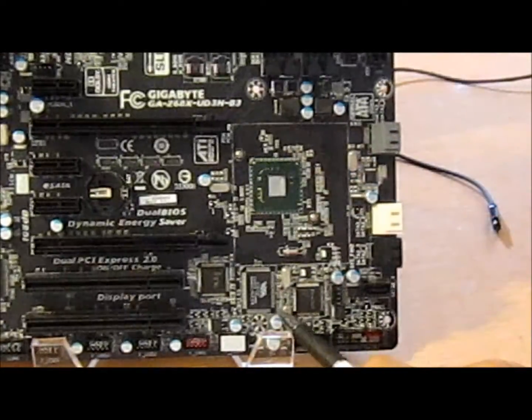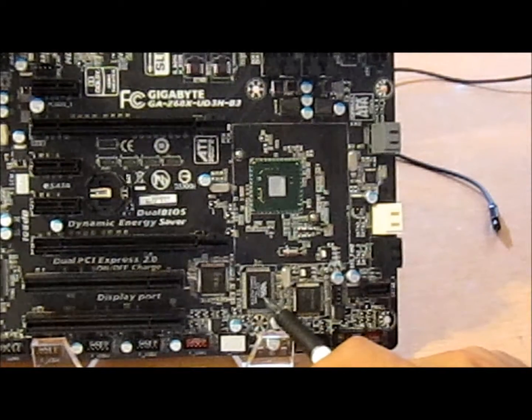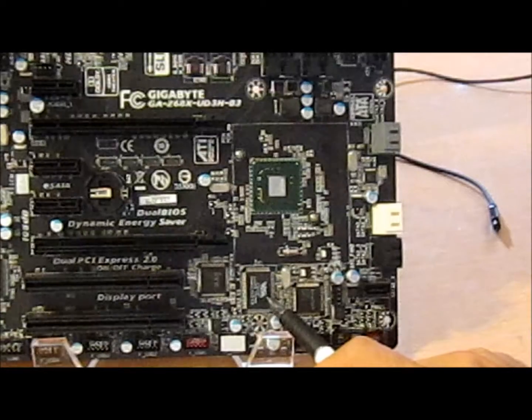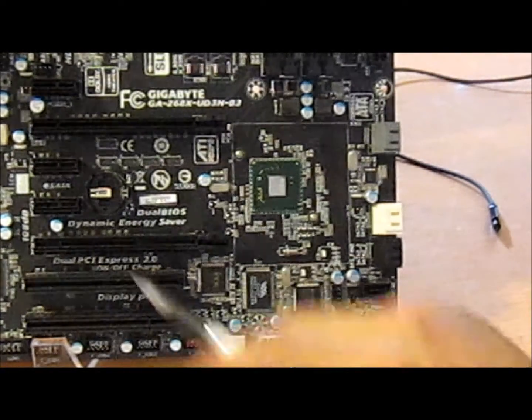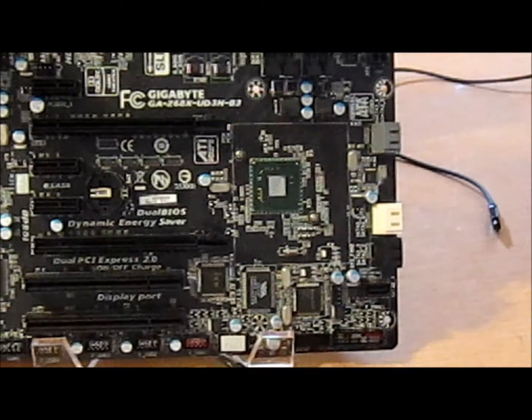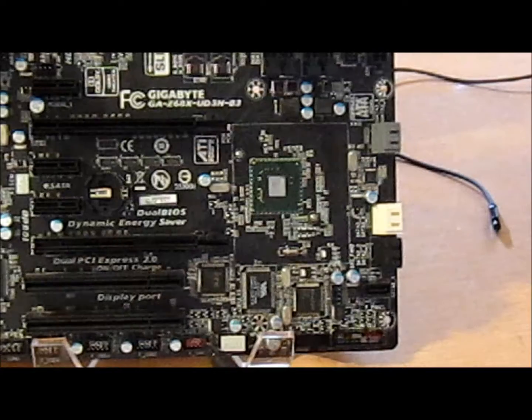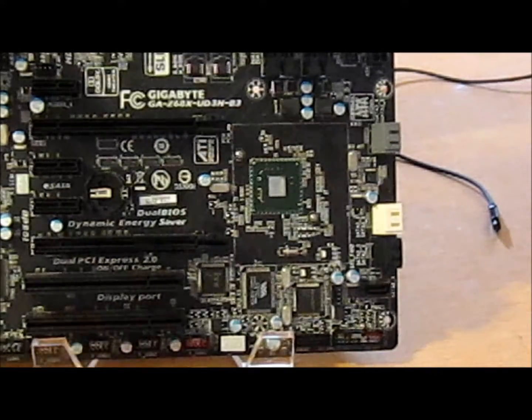Alright, so we move over here. We have the VT6308P. It's a VIA chip, and it provides 1394A IEEE, and you find it on most motherboards that have this 1394A. One here and one here. Alright, there are 4 USB 2.0 ports here, internal headers, all from the PCH. Basically, this red one right here is on-off charge. COM port here provided by BGE receivers and transceivers.